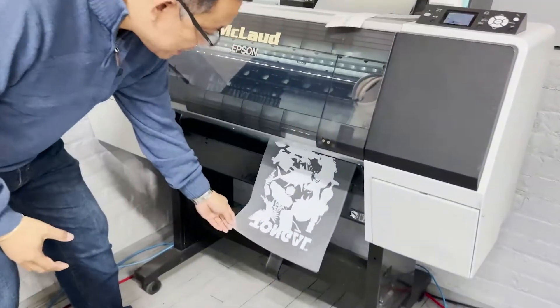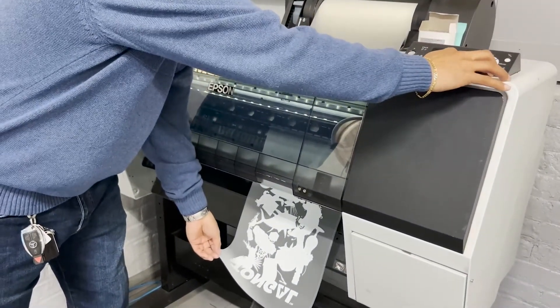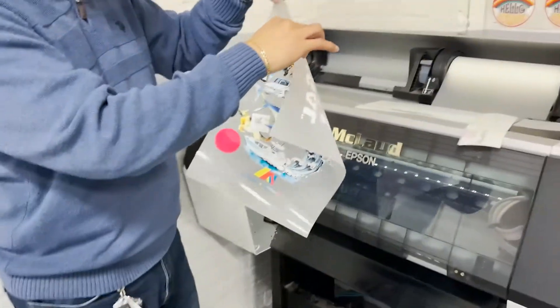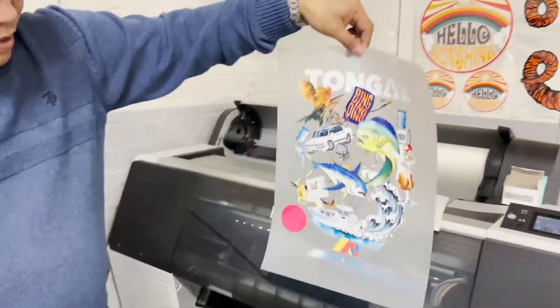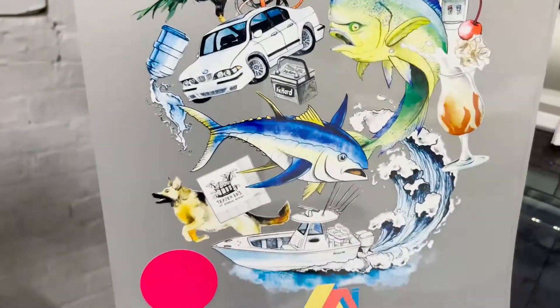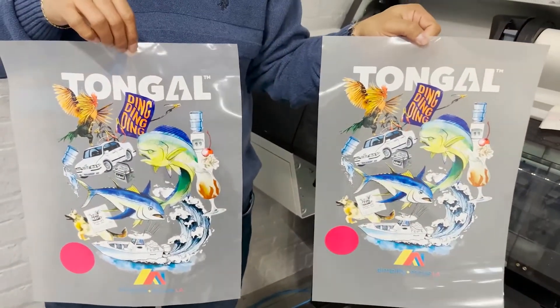What we did right now is CMYK plus three whites. Instead of four whites, this time it's three whites. You can take it down to six channels — we will have a next video where we do the six channel. So if you damage two of the channels, you can still run on six channels. Now let's cut this one and see what's the difference in color. This is the print of the seven channel, and this is the print of the eight channel.